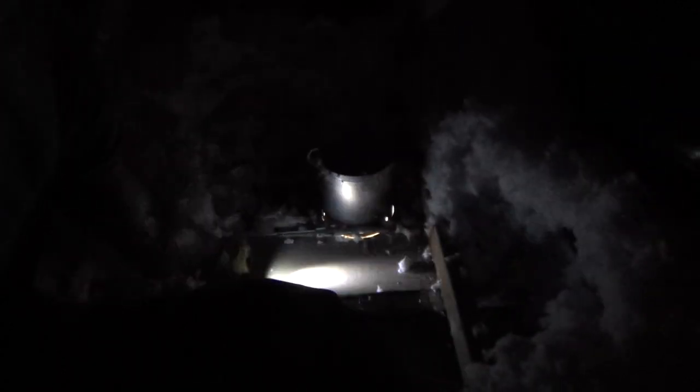I can tell the water was dripping at one point next to the can light. I thought it might be coming from the left-hand area up against the wall. If it had, I would see discoloration all the way over to the left. But pulling back that insulation, it's all dry over there — no discoloration like I see at the leak spot.